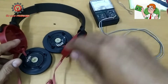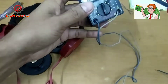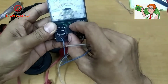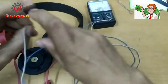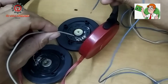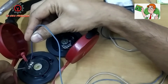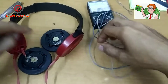I'm going to show you — hopefully the camera will capture it. I have a blog where I teach how to test a speaker. If you have a multitester, set it to times ten or times one. Let's test positive and negative — there should be a crack sound. It's working. The other one — it's working too. So we don't have a problem here.